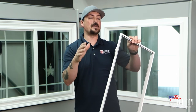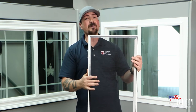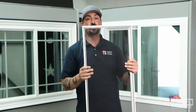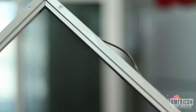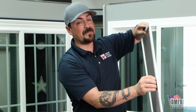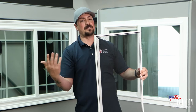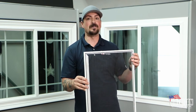Your best screen is going to be the extruded frames. Most window manufacturers will offer this as an upgrade. If pet mesh, stronger meshes, or solar screens are something you're really interested in, or you just want a frame that is going to withstand a little bit of abuse, an extruded screen frame is going to be the way to go. It still comes with a pull rail — this is all part of the extruded frame — very, very sturdy and strong. You're not going to have to deal with replacing the frames. If in 10 years the mesh is starting to get bad, you can have a local screen guy come out and re-roll. You'll never have to worry about these frames, so it saves you a ton of money on a re-roll in about 10 years or so.